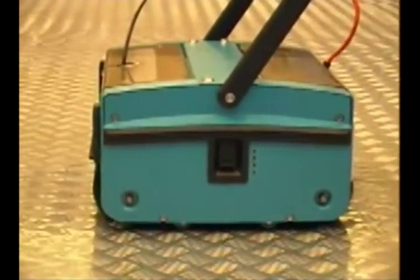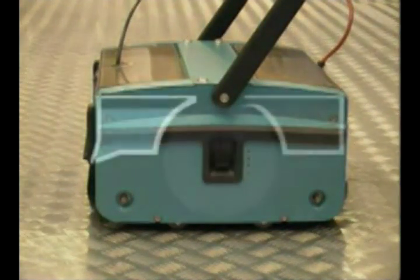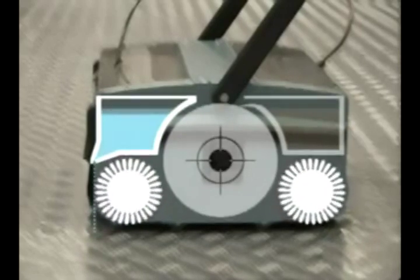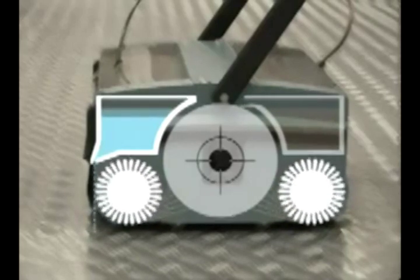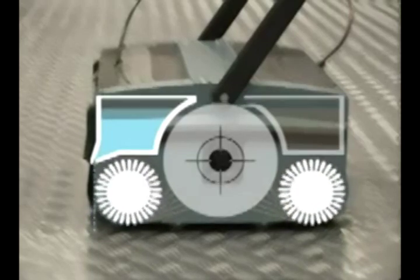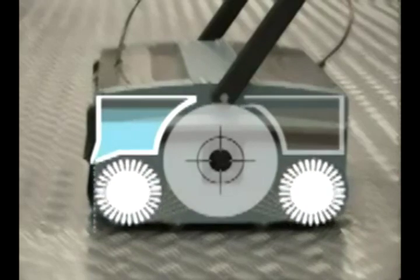A simple but effective combination of brushes, blades and the correct cleaning solution makes the Multi-Wash so versatile. The chemical solution is dispensed from the front tank, directly onto the surface to be cleaned. Two brushes rotating in opposite directions scrub the floor, throwing the now dirty solution up onto the drum. This contra-rotating action means no dirt can escape. The front brush initiates the scrubbing and the rear brush completes the process, drying the floor at the same time.